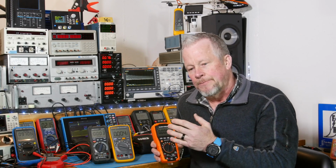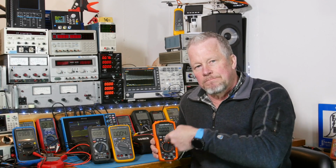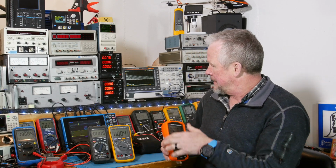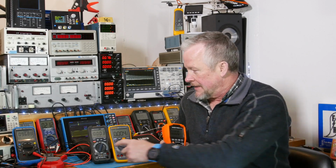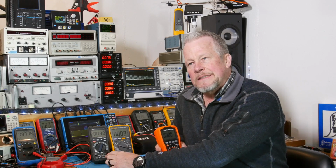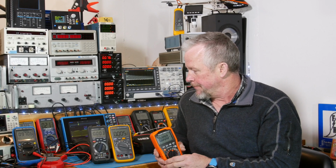And so that means you can't put a small wire in any of these orifices. It's sealed up for that. It's tight enough. Maybe some of these other meters that don't have it, you could squeeze a wire into. I don't know. But now this guy with the 67, a 5 means pretty close to dust proof. 6 means dust proof. So this guy is sealed up pretty tight.